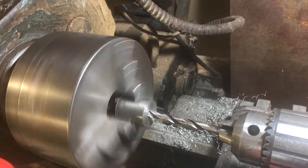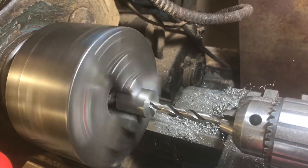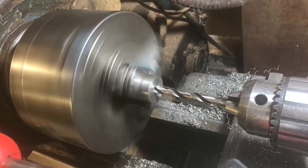There's stainless steel I'm drilling, so it's actually quite hard. You don't want to drill too fast or it'll get your drill very hot, turn it blue, and then it's useless.